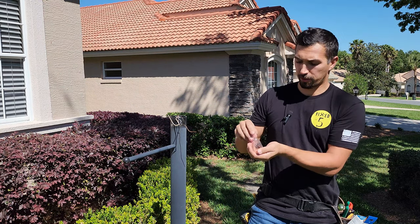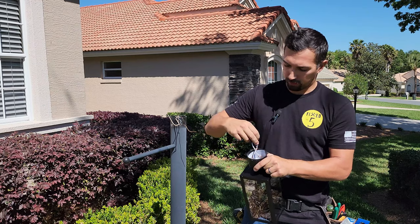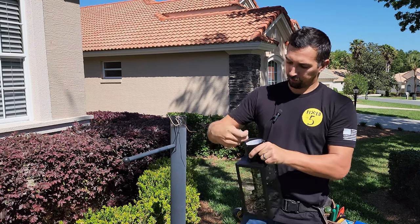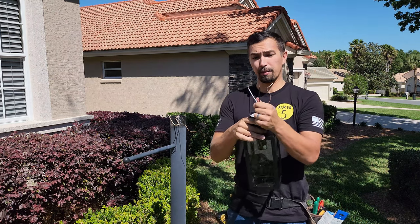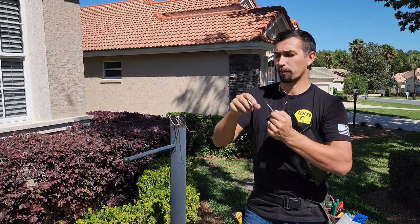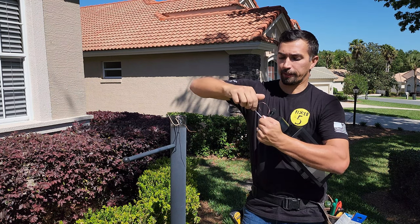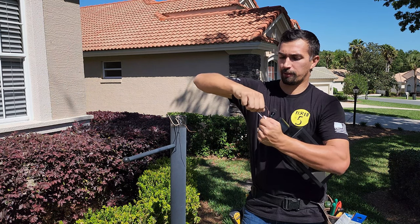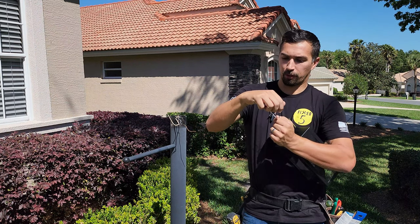You're going to open up your new wire nuts. You have your new lamp right here underneath it. You're going to undo the bundle. Sometimes these aren't cut back enough and I like to go ahead and cut them back a little bit more before I wrap them around the wire. But these look like they're done perfect. I just like to twist the tops to make them all tight.